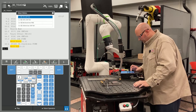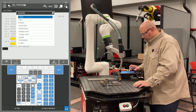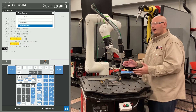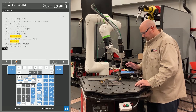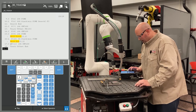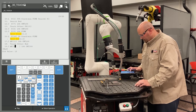Now I'm going to press F1 instruction and give the robot an instruction to stop adjusting the points with my program, so I'm going to select touch offset end. Then I'm going to record one final point to send the robot back home, changing my position ID number back to 1.